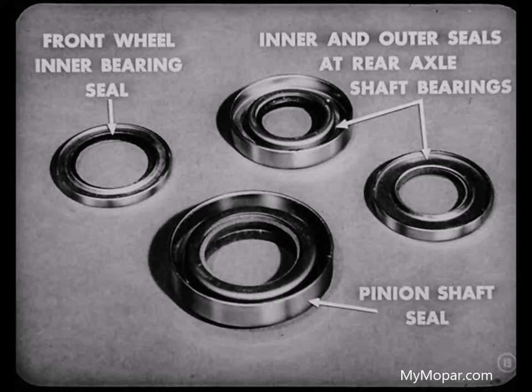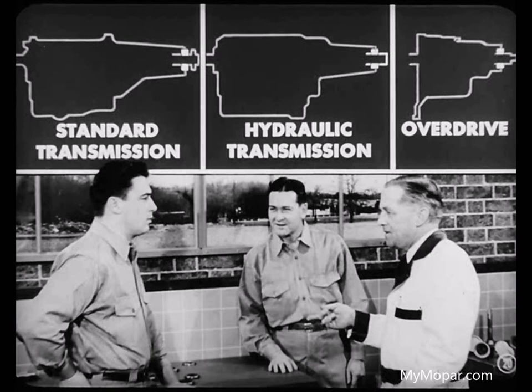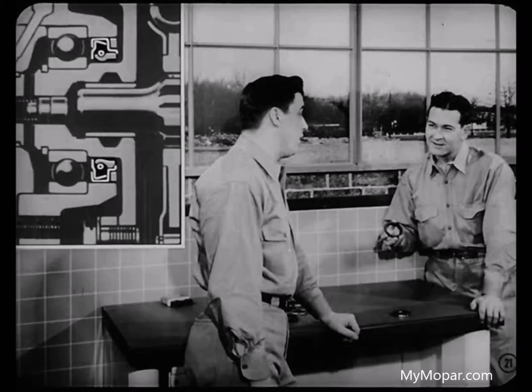That about covers the three main kinds of rotating shaft seals: encased, split type, and face type. You can always tell the encased seal by the metal container. The sealing part can be leather or synthetic rubber, spring-loaded or not. The container holds the seal in shape. On some shafts, there's a normal runout of a half to one and a half thousandths, so the seal needs a strong steel girdle to stay in shape.